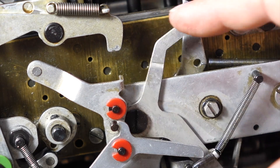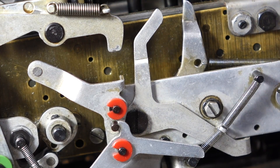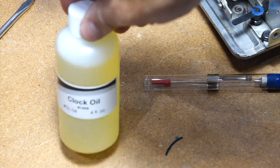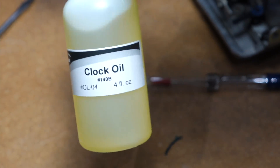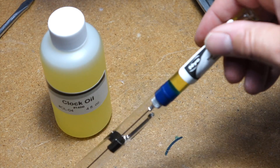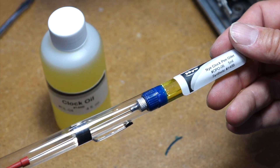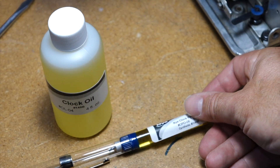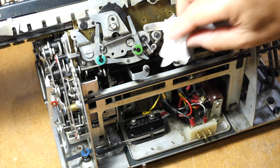Nope, that's not it. Oh, that is so sluggish. All right, let's do a little bit of oiling here first. Finally, I went and bought what I think is the right oil — a very light clock oil, super super light. It's called Nye Clock Oil, the 140B, the super light. And I think that's what I need. Look how sluggish that thing is.